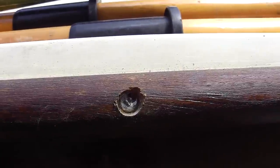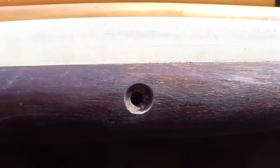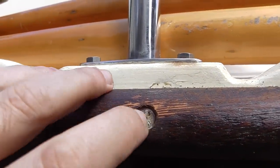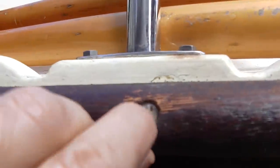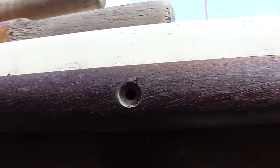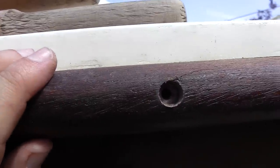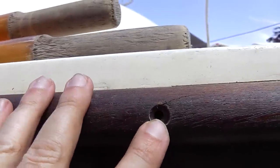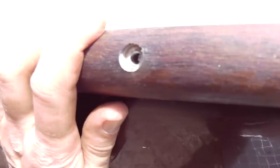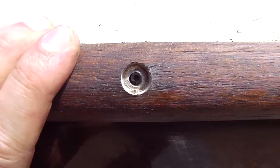Just to show you some of the tricky mess I'm dealing with — one came out cleanly, it's a rivet with a wire still in the middle, which is quite hard to deal with. Finally we're having to improvise each one. Some of them have been alright, like this one — that's okay. What we found is we drill the top off with a five-millimeter drill and then mostly we can push through with a center punch onto the inside. For the most part they're not covered up with fiberglass on the inside, they're just sitting there so it's not too bad.